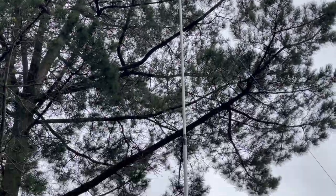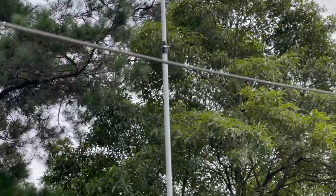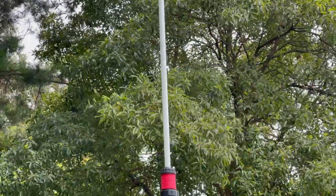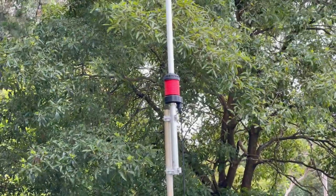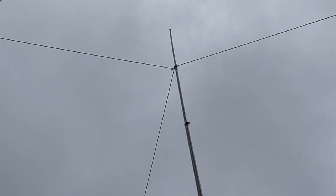Being nearly seven meters tall, this is a very flexible antenna and it doesn't take much of a breeze to send it moving back and forth quite vigorously. So if you don't want to suffer a broken Gain Master, you really must guy the thing. I picked a windy day to take this video. I've guyed the antenna between the top and the second sections — this was the advice from Serio and it seems to work just fine. I used thin lightweight synthetic rope for this job and it only required three guys to stabilize the entire antenna effectively.